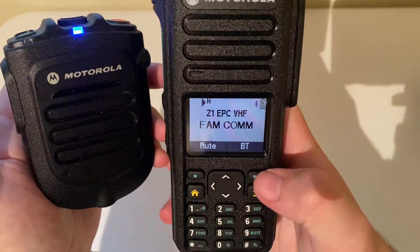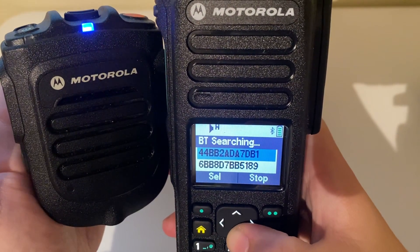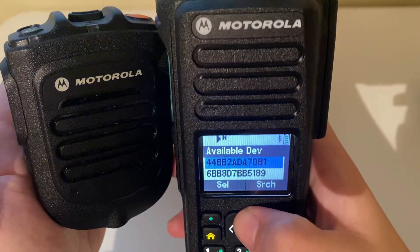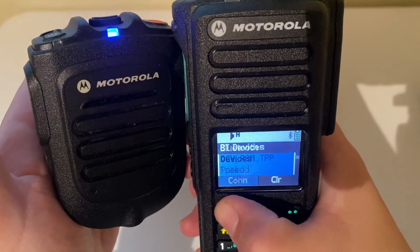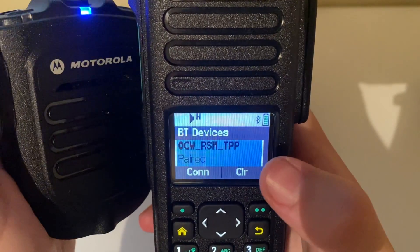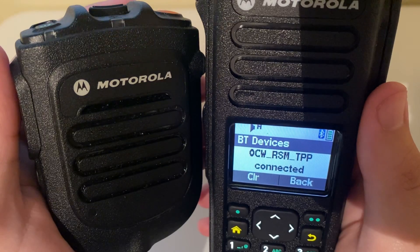After clearing, it says 'Motorola Solutions, power on, cleared, searching for host.' At this point, come back to the APX 900, go to Bluetooth, and go to Search Devices and turn that on. It might take a little bit — bear with it as it's searching. Since I've already paired this RSM with this radio, it pops right up. We push connect and it says 'searching for host' then 'connecting' and 'connected.'